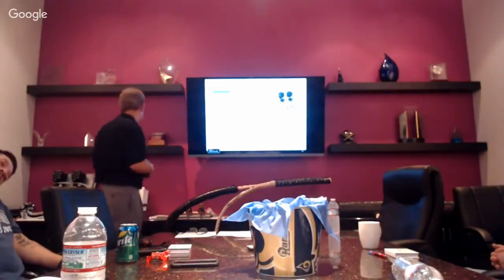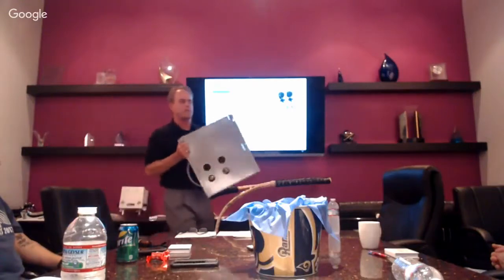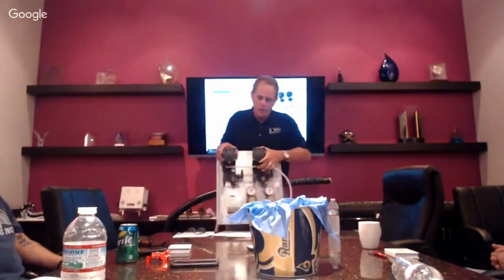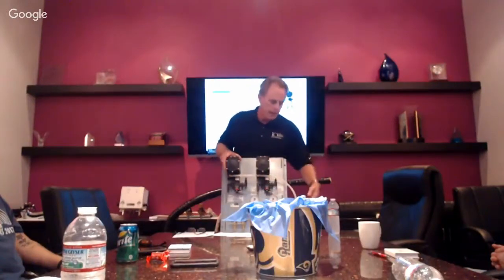The beer pumps we've talked a little bit about, but this is kind of the size beer pump panel I like. I like the two pump panels. Because most of the time, when you see a two-pump panel, you see two gauges, you figure one gauge for each pump, and that's not the case. So the air comes in here. This valve controls the pressure to the two kegs.